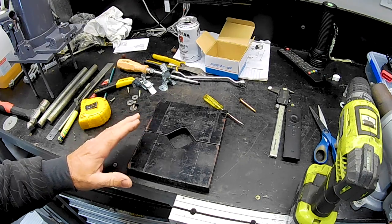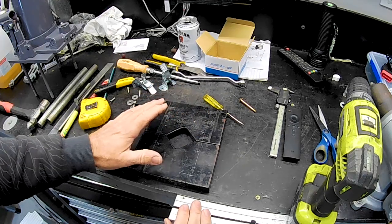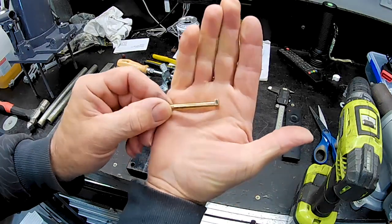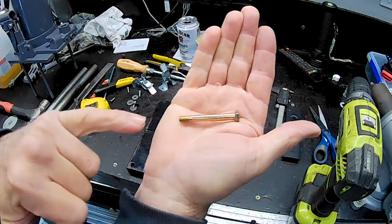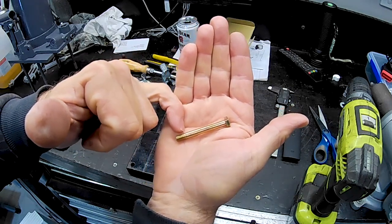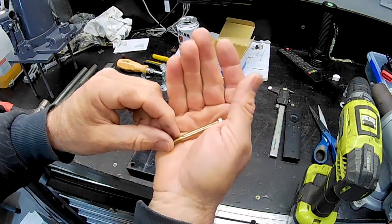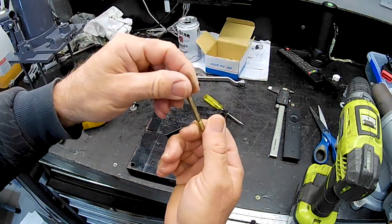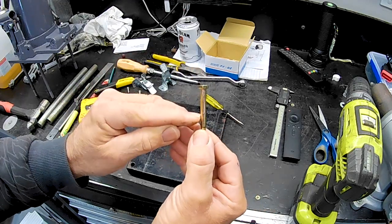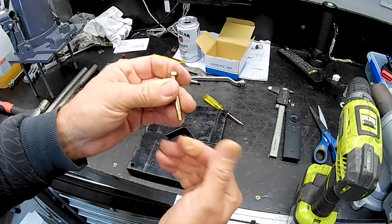So what I'm setting this up for is I'm going to put some pins in them so they'll sit between the rails of the pressing table. What I've got here, folks, are just some 6mm bolts with a bit of thread on them. What I was after was a nice smooth shank. I'm going to drill and tap into the press plates and then bolt these in, do these up with a bit of Loctite on them, and then cut them off protruding out about 20mm and just round the ends over.